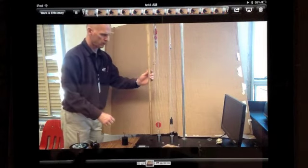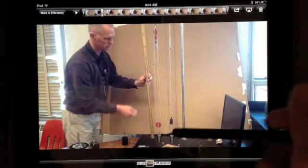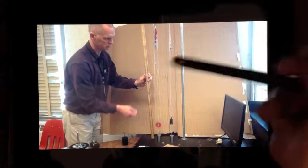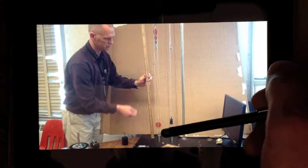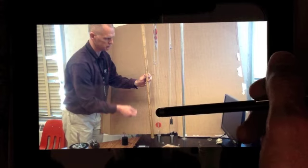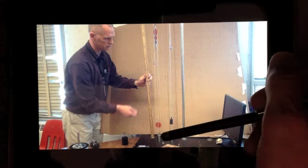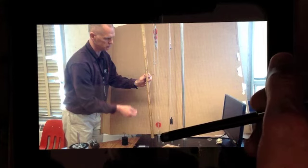You can measure four things. The first thing I'm going to measure is what I'm pointing out there. You're going to measure the distance this goes up and the distance that you pull down. What goes up, pulling the weight up, is your output. So there's two parts of that. There's the distance it goes up, that's the output distance, or D out, and there's the force that you're pulling up with, that you're getting out. So the force is just the force of gravity that you're overcoming, the force of gravity due to the mass here.